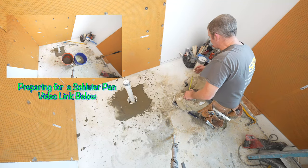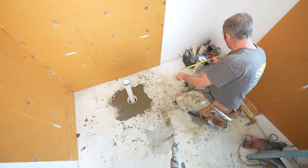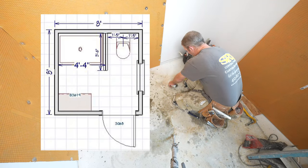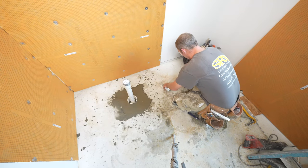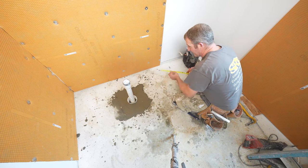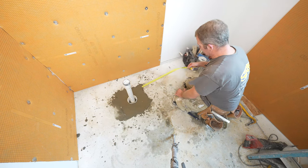So in this instance, I'm kind of matching what's from the wall. So from the wall, it's 17 inches. So that's what I want to match for the knee wall. So the edge of my knee wall is going to be 17. So then we'll go 4.5 inches, because we want to have that drywall work there. And so the whole dimension is going to be about 51 inches.